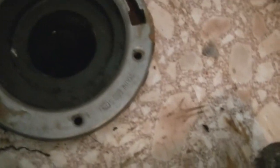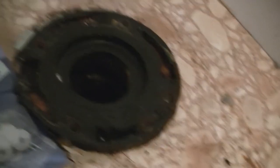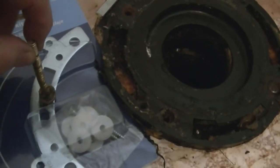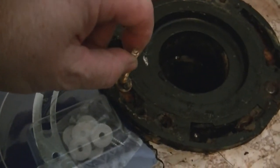Last time I was here I thought the previous fix was going to be the answer, but it's not strong enough to hold the bolt by itself, and the plastic is so chewed up that it just popped out — so that didn't work. My next solution is another piece of metal that's keyed. I'm going to put it underneath the flange and bolt it straight to the floor. This will key into that and it's going to hold for sure — I just have to make sure it's in the proper location before I tighten it all down.